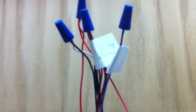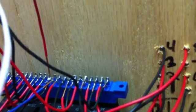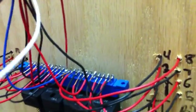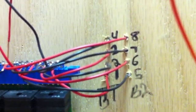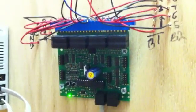We have AC power connections that you have to wire up — the documentation will tell you which one that is — and you also have a ground. From there you have sub power districts: the first pin goes into the common, and there are four of those because it's 16 detection zones across four sub-zones. Those four sub-zone wires go together and then run back to the DCS50. We staggered colors just to keep track of one zone to the next. Our detection zones are blocked out here, and from there we go out to the various power leads — a certain detection block might have three leads, and you just wire those together. I've had absolutely no trouble with that.